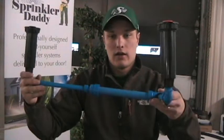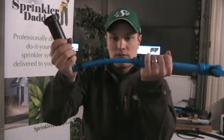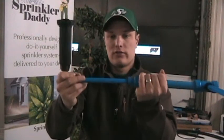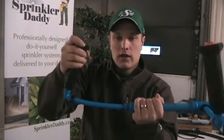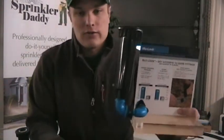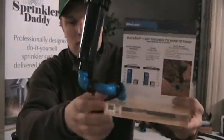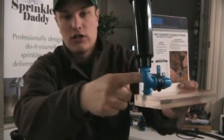Now the other option for these swing joints — if you want a little bit extra — is that it's pretty flexible pipe, so it gives a little bit of give. If there's ever any pressure on the head it gives a little bit more than putting it right on top of the line. But what makes it even better is if you add in two more additional elbows to your swing assembly.